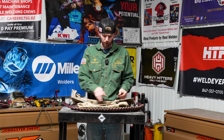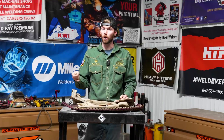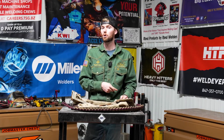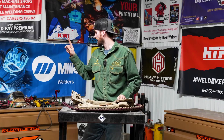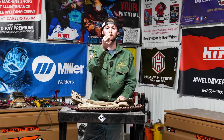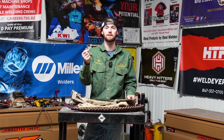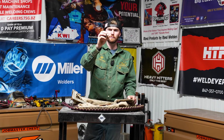The last couple of items rolling around at the bottom of the bag are a tiny piece of tungsten, another coupler for the TIG torch in case I lose it, and a spare collet to stick in my TIG torch. A lot of welders carry tungsten holders, but at a certain skill level you don't gum up your tungsten much. I keep my tungsten in my TIG rig and just sharpen it when needed. The tool rooms have tungsten too, so I only carry a small spare piece.